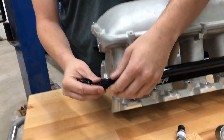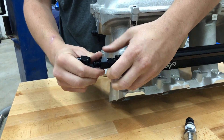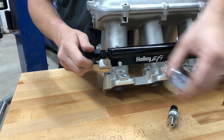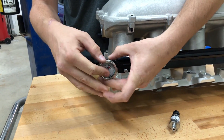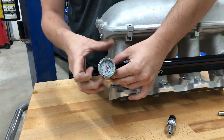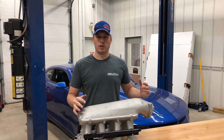You're going to screw this back on right where it goes — it's a swivel so you can adjust it. Put your hose end back on, screw your eighth-inch NPT gauge or pressure transducer in, and you're good to go. The nice thing is you don't have to redo a bunch of plumbing, and it makes things really easy.